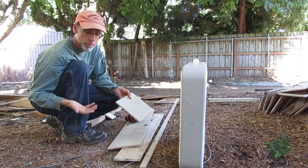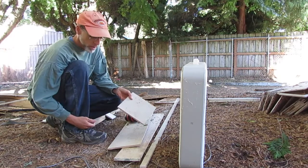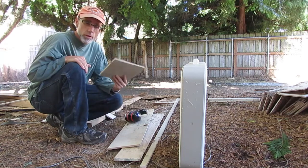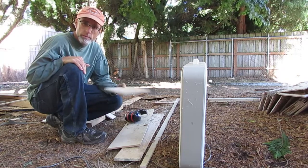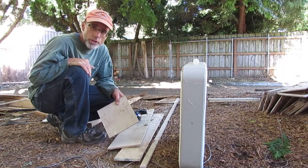Like I said, I just held my breath — for what, a two-second cut? That's pretty easy to do. Most of the dust went blowing behind me. So if you're just doing a little bit of repair work with your HardiePlank, here's an easy tip for making some quick cuts. Thanks for watching.